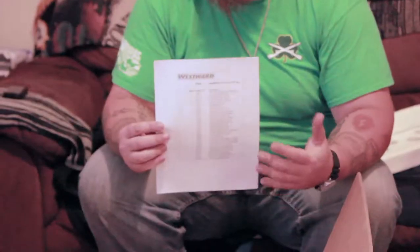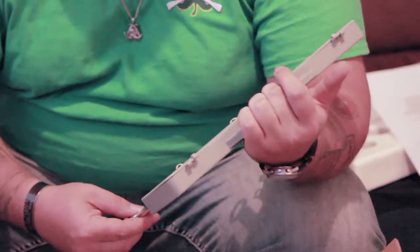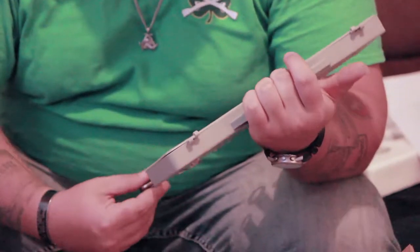It actually comes with a sheet that's got everything in here. So once again, if you have an opportunity to fill out for this scholarship, you're doing yourself an injustice if you don't. There is a rubber hammer, the soft hammer. If you're ever using brass or copper work and you don't want to mushroom out something, or you don't want a metal-on-metal hit to it, a rubber hammer — kind of like a mallet — works perfectly fine. Open-ended wrenches, a whole set of them. This is an 11-piece set, all the metric stuff, going from seven all the way up to 19 millimeter.